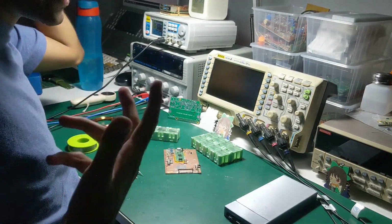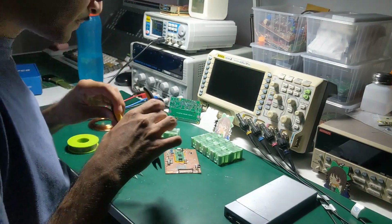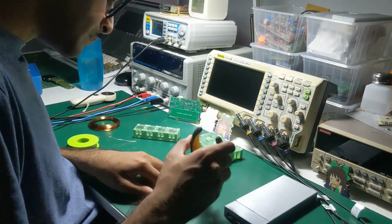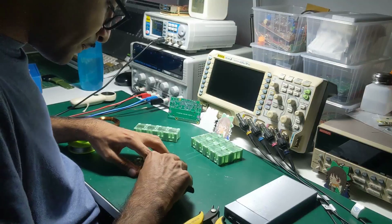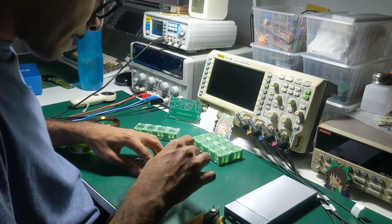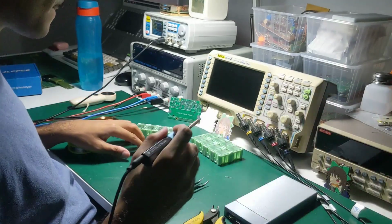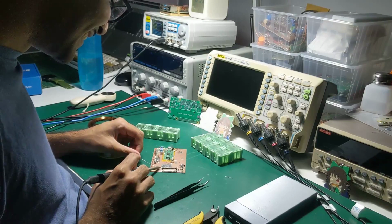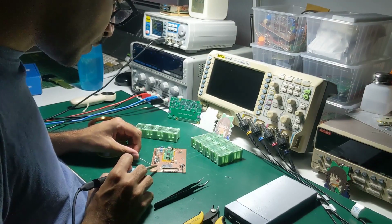And the problem is the main bridge was injecting current into the other switches, just backwards. So I needed to decouple the driver from the output stage somehow, and you cannot do it with the follower because you have pooling effects. We have a tool for that. It was called an opto-isolator. I wish they were 100 kilohertz square capable.